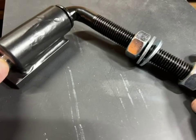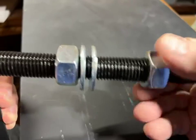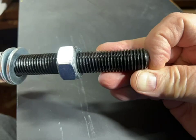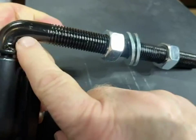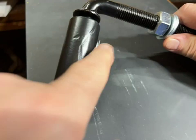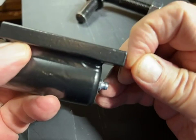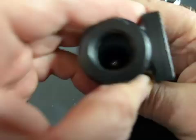This is one very solid hinge. You have to buy them individually. It has the J-bolt — a three-quarter inch bolt with heavy nuts and washers. It's threaded all the way to the turn, or just before the turn, and it has this very solid hinge set up to be welded onto something else: either a flat mount that you've manufactured or onto your fence post. That's good thick three-eighths plate, and the construction is interesting.